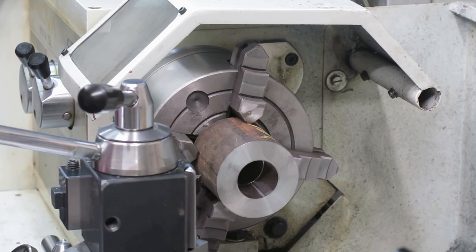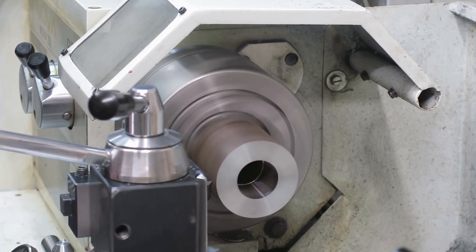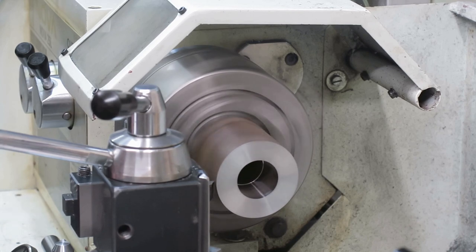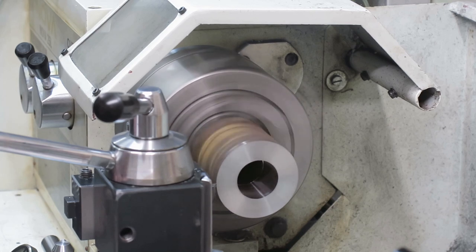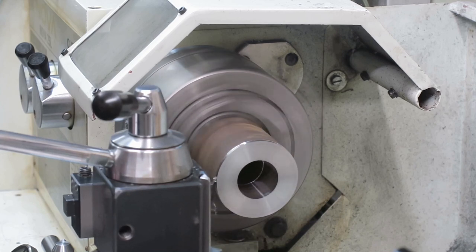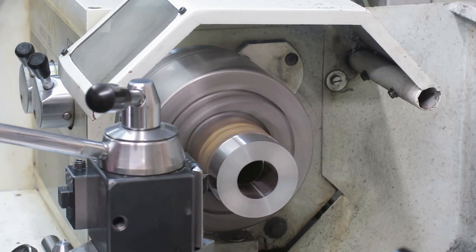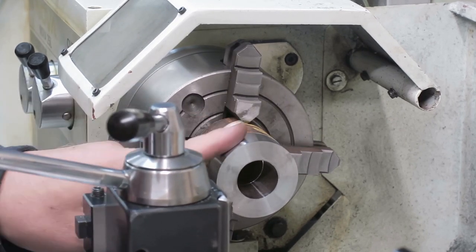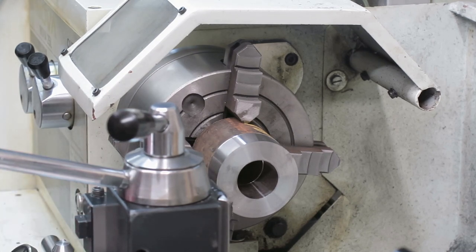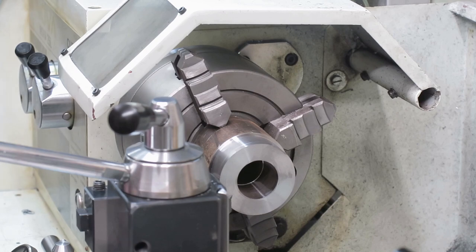This is again a Cermet insert. They are incredibly tough. If it clears with that, it does. Well, we need to take it down to 51 millimeters. So last millimeter, I will take, let's first check that it is the last millimeter. It should be 52 now. It is, so the last millimeter.